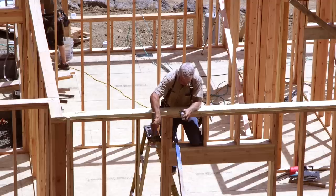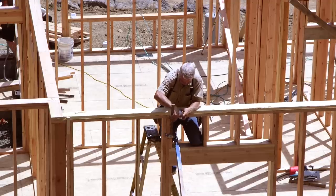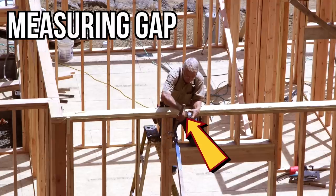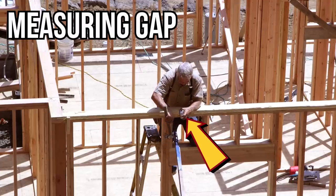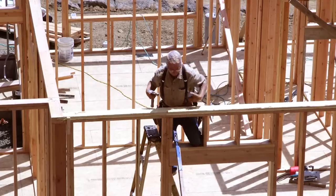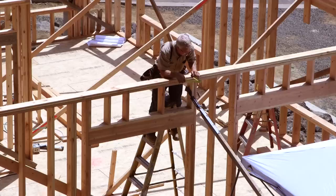Maybe a wall was inadvertently cut with 2 different length plates, a longer top plate or a longer bottom plate. If you snoop around, you might be able to find the exact place the mistake was made, correct it, and everything right then should start to get a lot less frustrating and things should begin to fall into place.